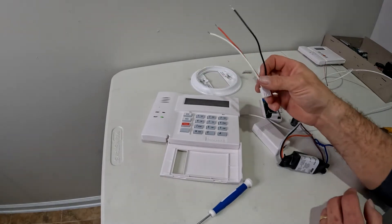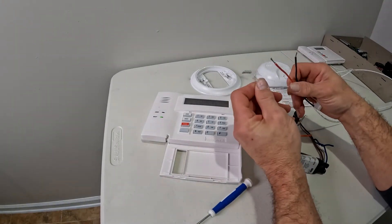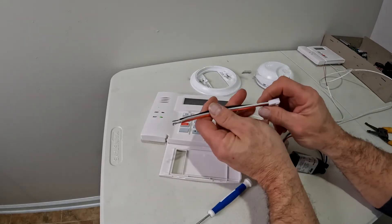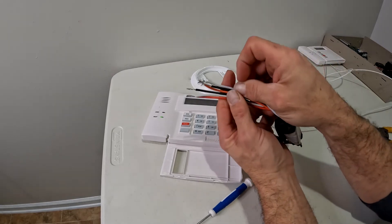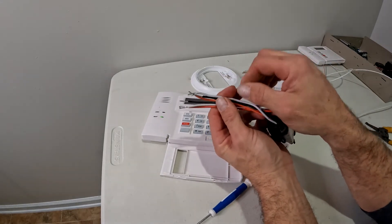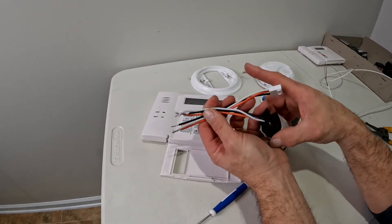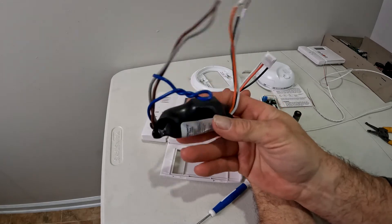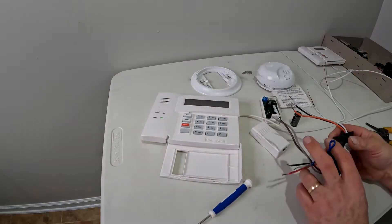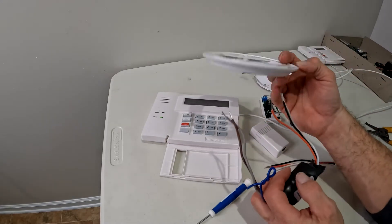Try to find the end of the loop for all your smoke detectors — get the one that's furthest away from the electrical panel. When they wire these smoke detectors together, you'll have two sets of wires coming in, looping from smoke detector to smoke detector until you get to the end. The last one will only have one set of wires hanging down, giving you more room in the electrical box. It's going to be easier for me to show you how to wire this on a table versus up in a ceiling.